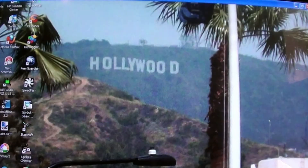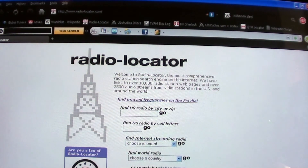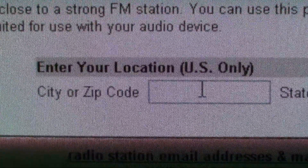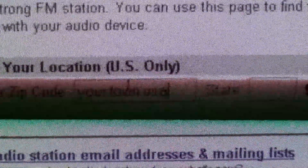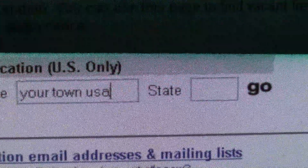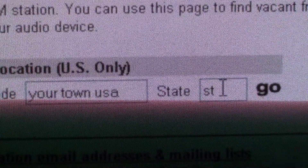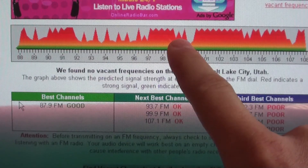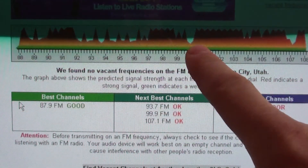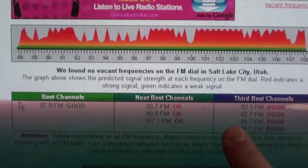Some of you asked me about Radio Locator. Here's how it works: you go to the site and if you're in the US, type in your town and state and it will show you a list of open frequencies that might be good to transmit on. This isn't foolproof but does a pretty good job showing you where on the FM dial you can broadcast. The dips are where no stations are on the dial; the spikes are where stations are most powerful; and the bottomless areas show a good frequency to transmit on. Again, this isn't foolproof but it's better than nothing.